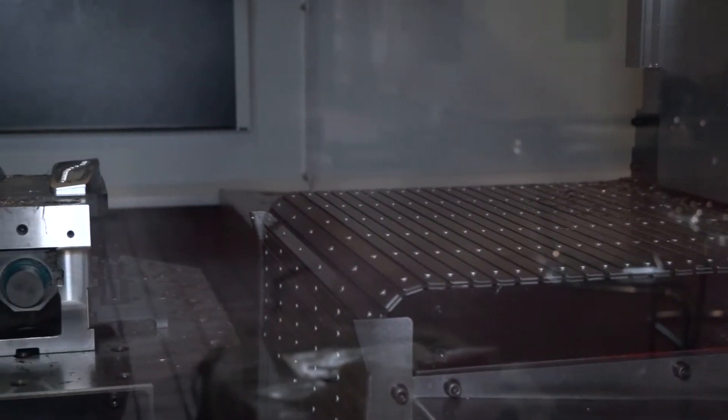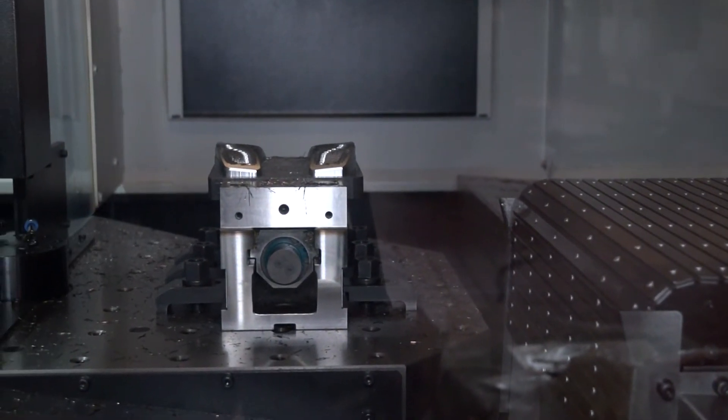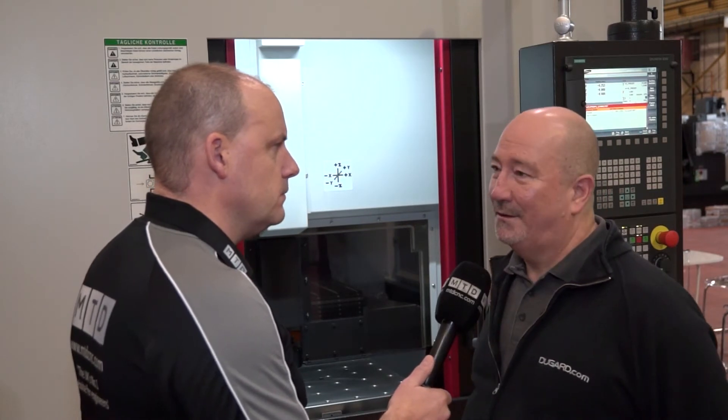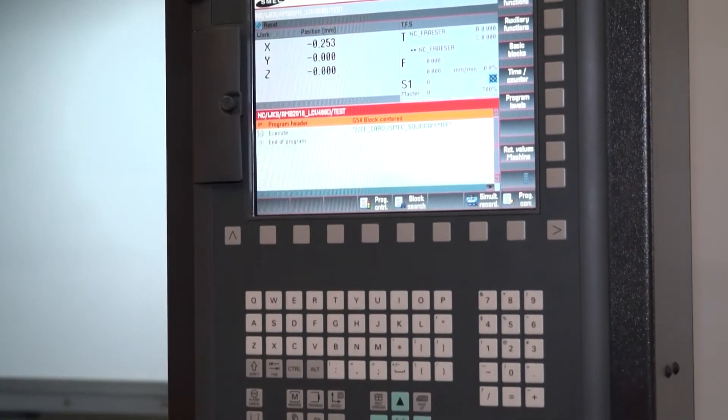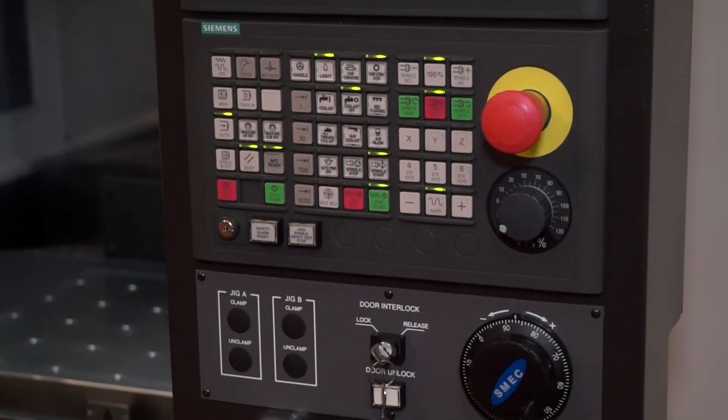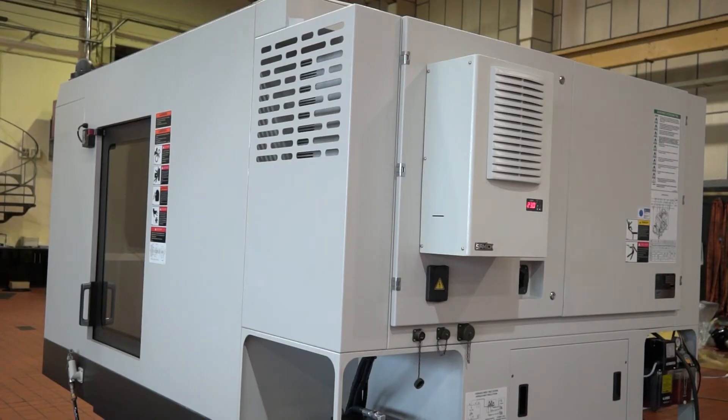It's quite a heavy machine as well, so I can expect this isn't just an aluminium production tool? No, we've cut it on steel very successfully. Speed is of the essence with this type of machine. Two things that are important — firstly tool change time. What's the speed of that on this machine? You've got 1.6 seconds chip to chip.